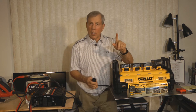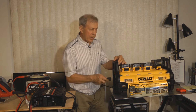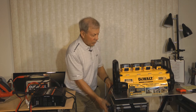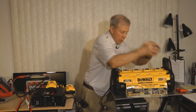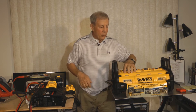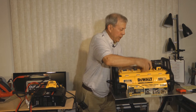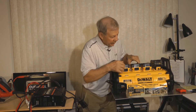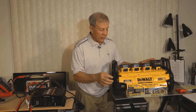I also asked: what if I leave it and come back wanting to charge it? She said don't plug it in while the batteries are in the unit, because the spike of plugging it in goes directly to the batteries and can damage them over time. So you have to unload the batteries, then plug it in. It resets itself, the lights blink to confirm everything's okay, then load the batteries in. If they're not at 100% capacity they will blink — make sure they're deep seated. As they come up to full charge they go to a steady state.